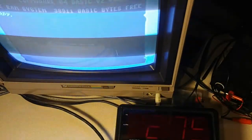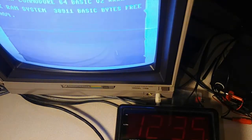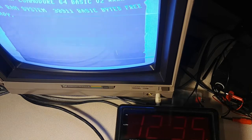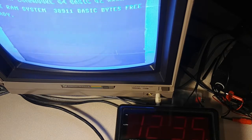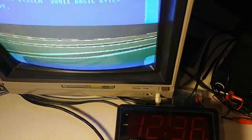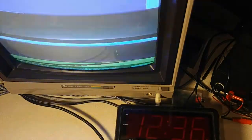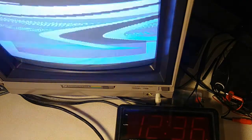All right, so now look what's happening here — it's glitching on the screen. It's getting wavy lines there and stuff. That is not good. So we're just a few minutes since we turned this thing on and it's starting to glitch out, rippling up and down the side of the screen. Now it's getting a little worse, losing sync. I can still see the banner and the ready prompt back there, but it's glitching pretty bad. Some of the characters are corrupted — it no longer says ready, there's some other characters in there — so something's definitely wrong.